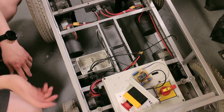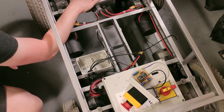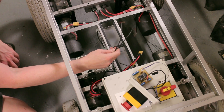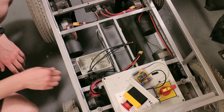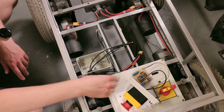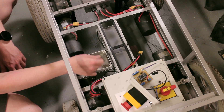I've also started some of the cable management to route the wires in. The motor controllers at either end have got a signal cable, which is now being fed through, so I've got two of those signal cables into here. I've also run a 5V supply through. At the moment this comes from the box in here, but that's something to be solved at a later date — it's just a temporary 5V supply running inside. In the meantime I'm going to get this wired up.